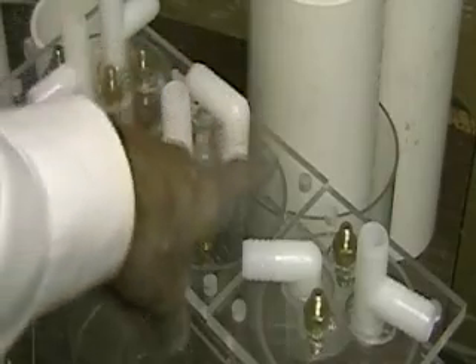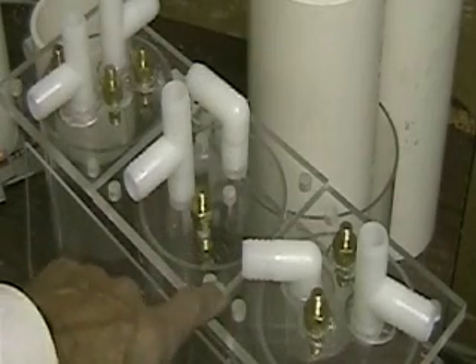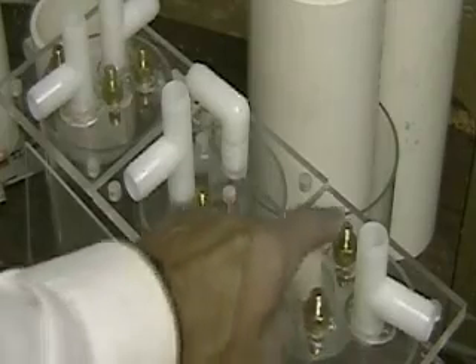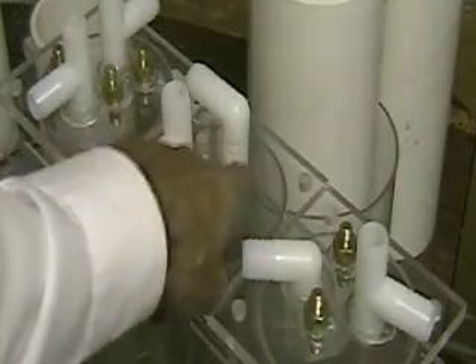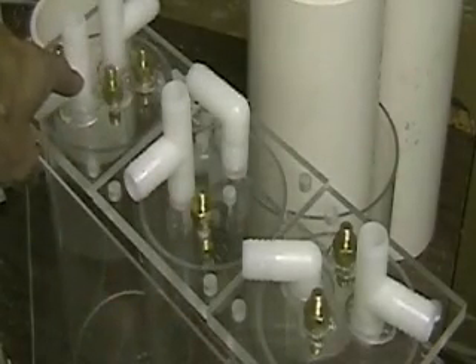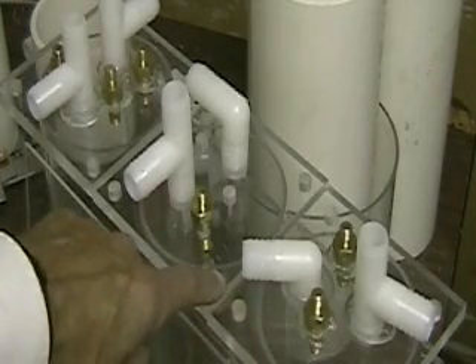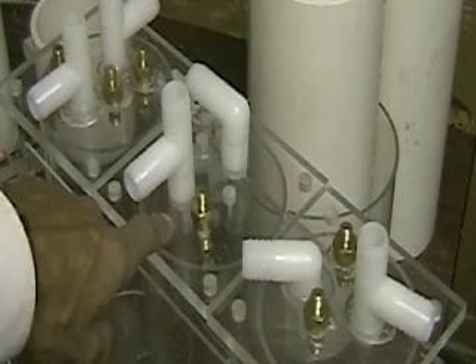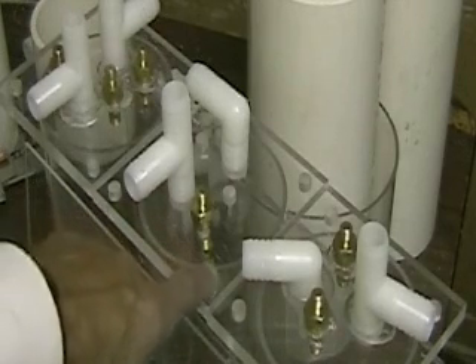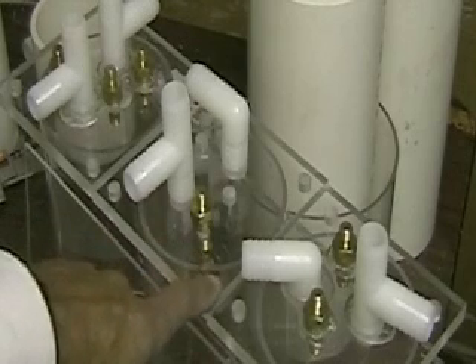All the tubes — the majority of the tubes that you're looking at the top here — are connected together. I can't tell you exactly how that works just yet. You see the electrodes here, and there are two other types of electrodes that go here that you do not see. There are three on this system over here. All the electrodes can be controlled manually or with one switch. There's an electronic box that controls the electrode system so that there's always a continuous amount of current.